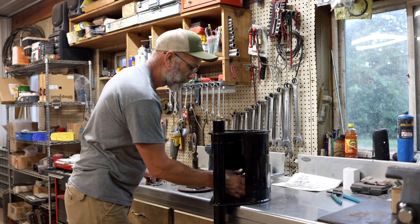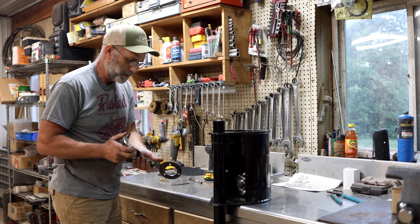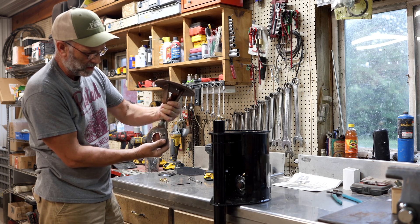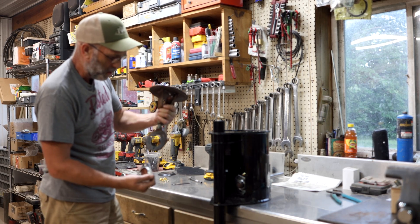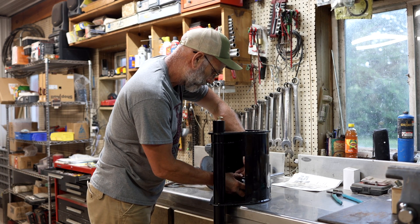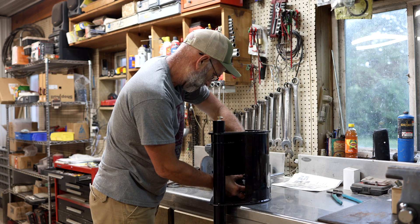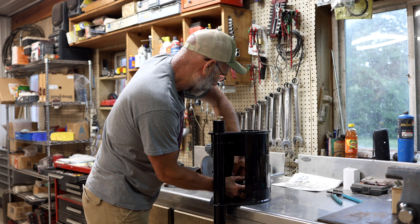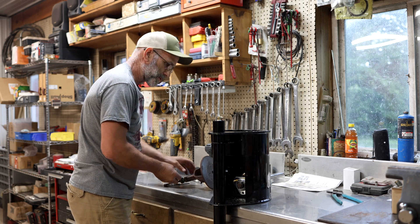The bearing is already in with the flange on behind it. Some people make the mistake of putting the bearing in between the two flanges — it does not go that way. It goes like this: put the flanges together, then put this on the outside around the bolts all the way through. I'll put two of them in now because if I put the third one in I'll just knock it out anyway.